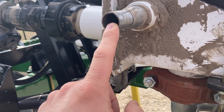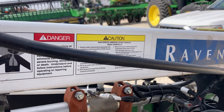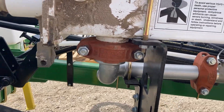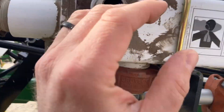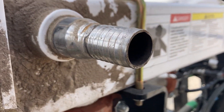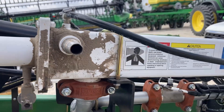This applies to a Raven or a Continental Torpedo. The older Ravens are pretty notorious for this because they have a little tiny orifice in the other end of the cooler that gets plugged up — you take off the four bolts, slide the tube out of the middle, and there it is. Taking the cooler apart is a last resort. We can blow air into the cooler to try to loosen things up — put a hand over one side, put air into the other side, and you should have pressurized air coming out. Push it back the other way, blow up through here, and it'll come up through the vapor inside the cooler.